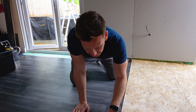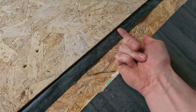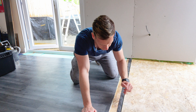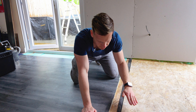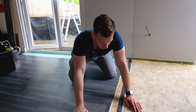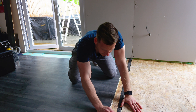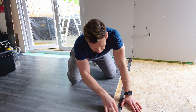While that's sorting itself out outside, I'm going to go down here, get on my knees and fill in this 5mm crack. When I put this flooring down, for some reason there's a bit of a 5mm lip on it so it's not lying exactly flush, which is what you want if you're laying flooring across. I don't know if that's because I bought slightly thicker floorboards the second time round, or whether there's a slight discrepancy in the joists when I laid it. Multiple reasons — it was four years ago, I'm not quite sure.